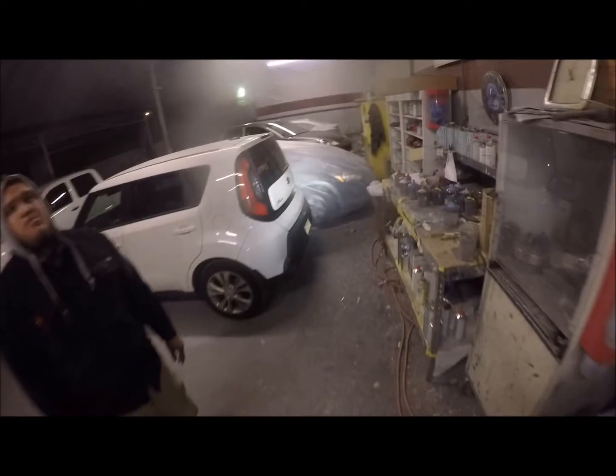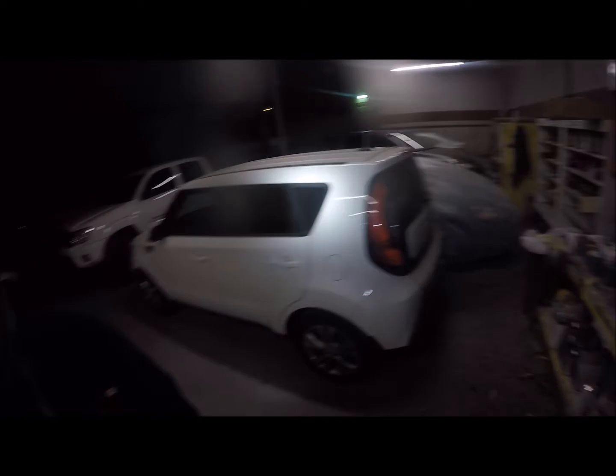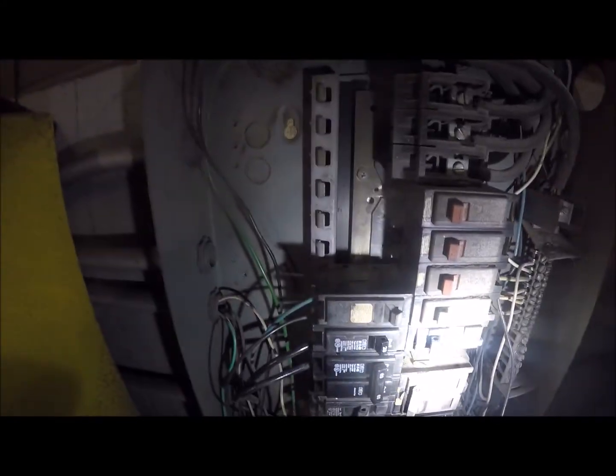But I can't get one till tomorrow. That one I have to actually go get over at CNC Electrical. They don't sell three-phase at Home Depot. Although, realistically, I don't need a three-phase panel. It's fine the way it is. Well, I could leave it, but that panel's pretty worn up. Dude, I can get a panel for less than $100. And the breakers were cheap. I use the same breakers. But that lug right there, that thing is just toast. Well, let it be. I tried to rehab that and it still didn't work.